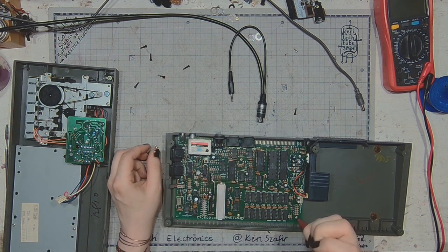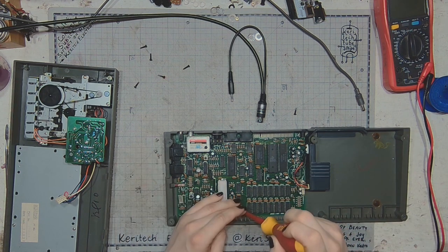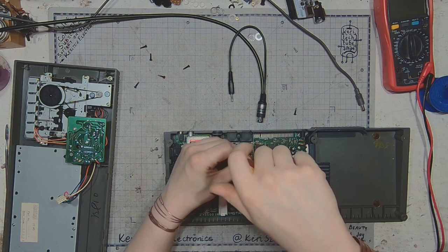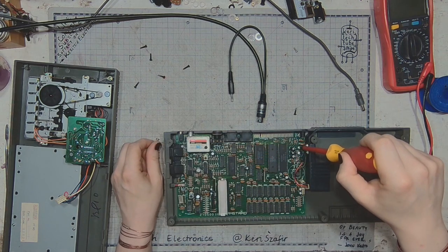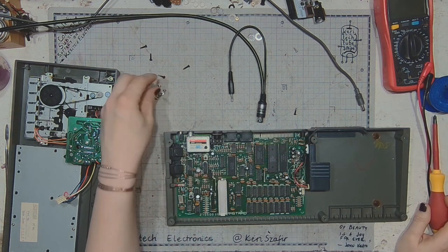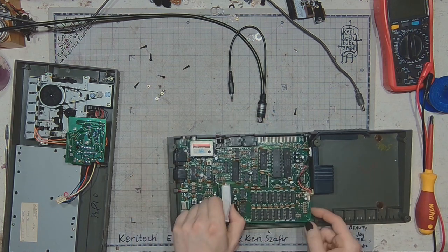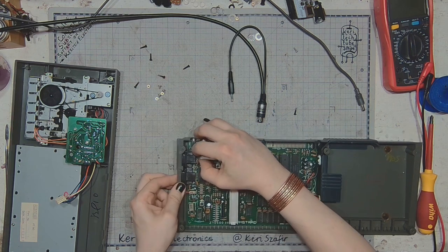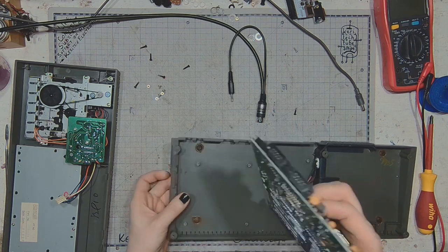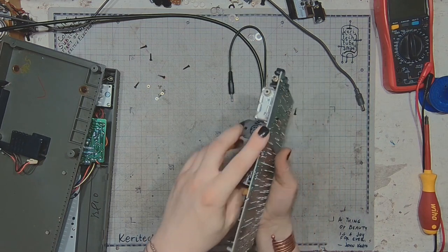What I definitely want to do is swapping the polarity on three transistors 2N3904, because those transistors are soldered in the opposite way. And I will also want to make a jumper modification of this Commodore, allowing me to derive the audio signal on this DIN connector.